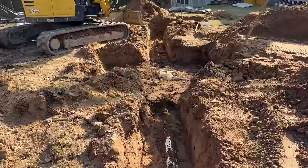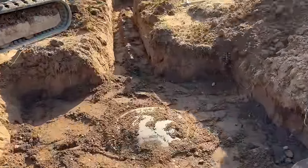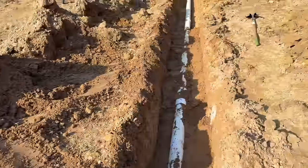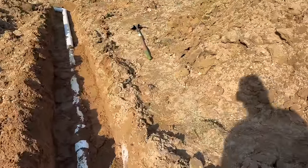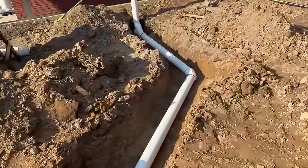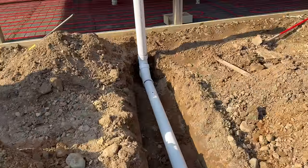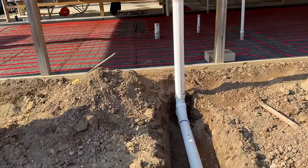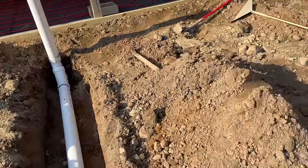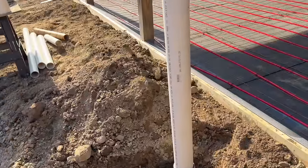All right, we got the septic in. Use one of those little bullet tanks. That's a tank. Line comes out of the building. We're just bedding that in sand now. And it comes over and it hooks into all the plumbing we did inside of there. And there's a clean out there, and a vent. Clean out / vent. Right there.